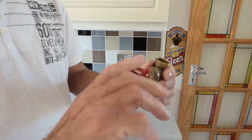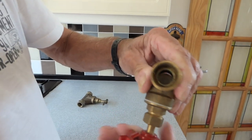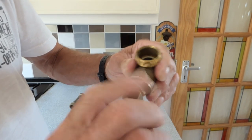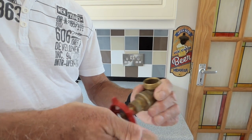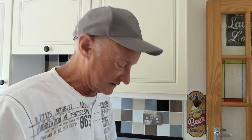Same thing: turn it all the way down. You'll notice a gate closing in there — that's the gate of the gate valve, which is why they're called that. Then turn it back on again. As with the stopcock: full on and then back just half a turn. That should prevent it from seizing up. So that's a little tip there.